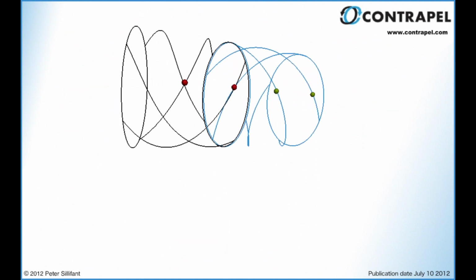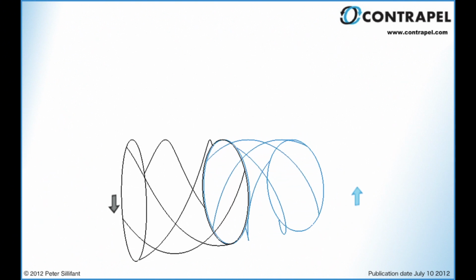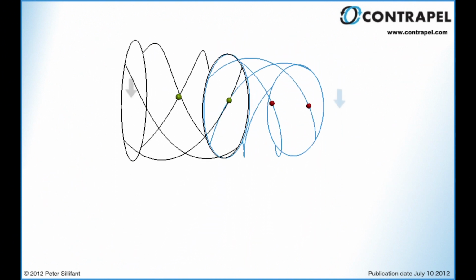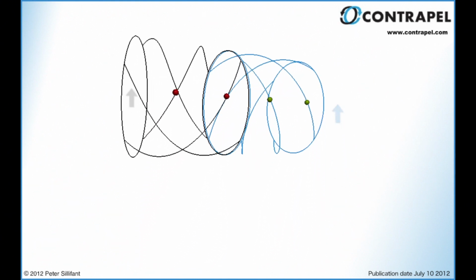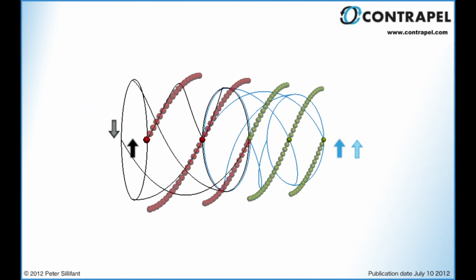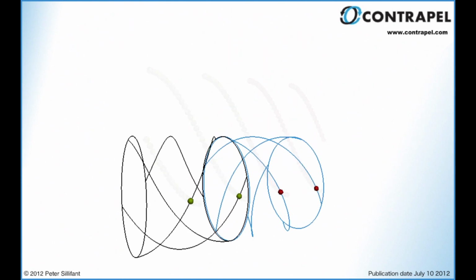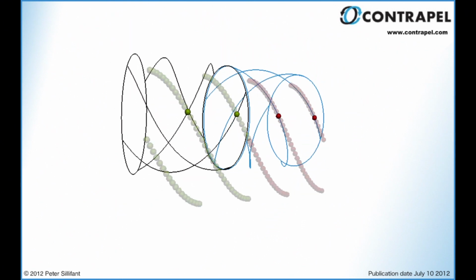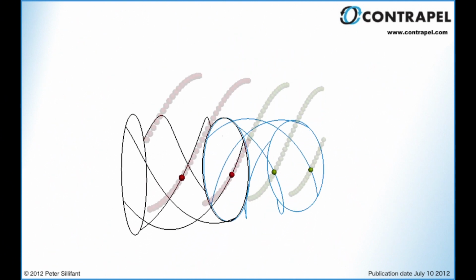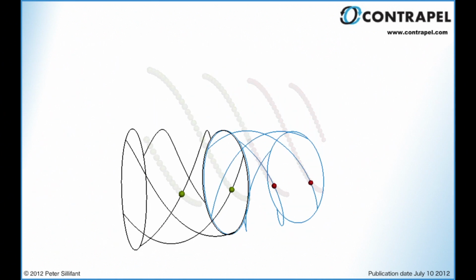The two propellers at this instant have identical vertical speeds, but oriented in opposing directions. The additive and subtractive oscillations then reverse as the oscillation once again begins to accelerate in the other direction. What results is a very gradual and smooth transition in the relative vertical velocities between the upstream and downstream blades, which corresponds with a smooth rhythmical transition in the force vectors transmitted into the propulsive medium.